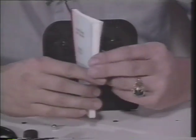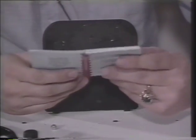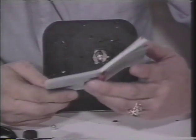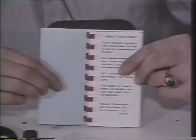The first, and probably least effective, is to take a book, such as this one, which details most safes in existence and what kind of locks they have. It then gives information regarding the rating of the safe, where the fence is, if it has a relocker, how the combination works, and exact drilling information, such as remove dial, up 7/8 of an inch, left 1/8 of an inch, line fence with wheels. Very handy little thing. As I say, it covers most safes you'd find.